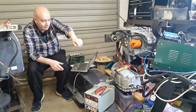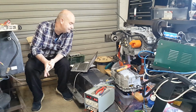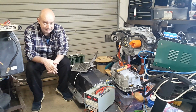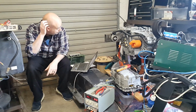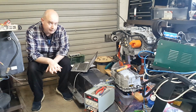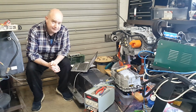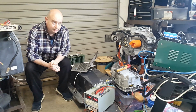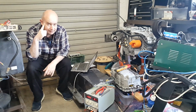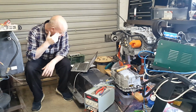We have 80 volts worth of DC going into the inverter. I don't have any coolant going through it at the minute. So it is shutting down sometimes when I try to put 350 amps into the motor. These cables smolder a bit, and then the heatsink gets up warm, and even though I try to ignore the heatsink temperature sensor, Toyota have already anticipated that, and the PWM shuts down. So, okay. Anyway,